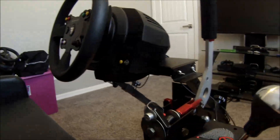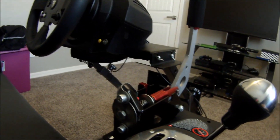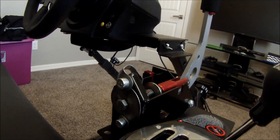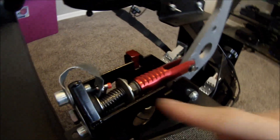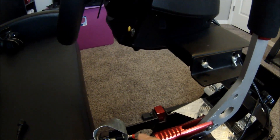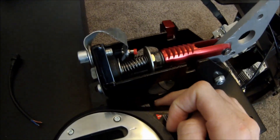When you first get it, there is going to be a master cylinder that hangs off the back here, and it's bolted on by these two allens. I just utilized the allens for this. You'll pull that off — the first thing you're going to do is pull those allens out and pull the master cylinder off. It's going to have a rod in the center of it connected to a plunger for the master cylinder that runs up into here. You'll end up taking loose this lock nut over here — this is part of the original stuff. The spring is inside the master cylinder and you're going to want to keep that. But besides that, there's not much else inside that you're going to want to keep.